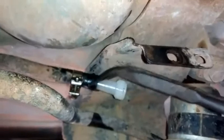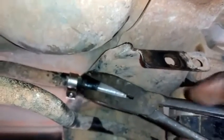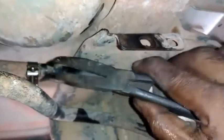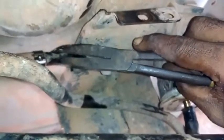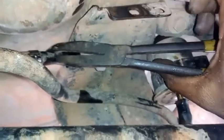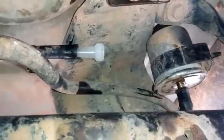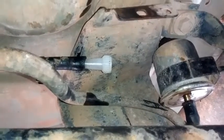During the process of removing this hose from the inlet side of the filter, place your tool like this, and as the hose is sliding off, clamp the end — squeezing the hose to prevent fluid from leaking. At that same time, place that plug into the hose spout outlet to prevent it from leaking.